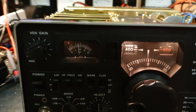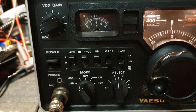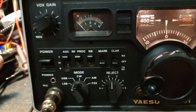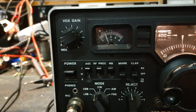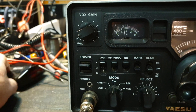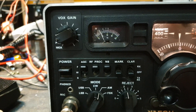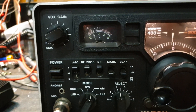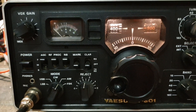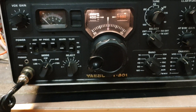Turning the generator off — you'll see the meter drops off too as it waits for a signal. On sideband, you can see it wants to flick; that's just the relay clicking in. On AM it's getting 10 watts out but no modulation. This pretty much tells us we need to pull the board out and have a look at what's going on.